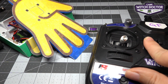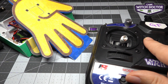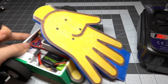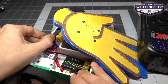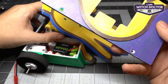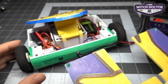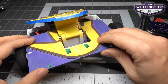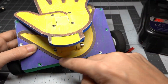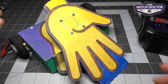I'm going to go ahead and put it how I like it — the lift arm just barely touches the floor. Now I'm going to turn my transmitter off and turn my robot off. The last step to finish this robot is to put a top plate on. For the lifter robot, just make sure that everything is below the top plate level so you're not going to pinch any wires. Then we're just going to slide the top plate on from the top and install all the top plate screws to make sure it's on nice and secure. And your lifter robot is done.